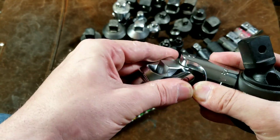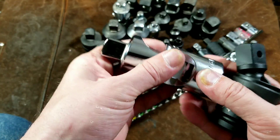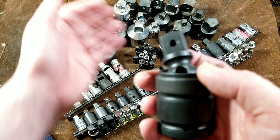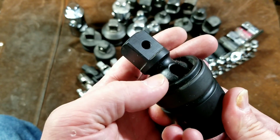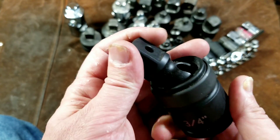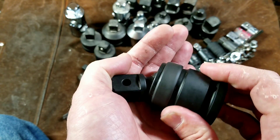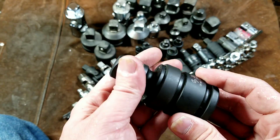Standard universals are a little notchy and clunky because of the way the joints are offset, but they're a real lifesaver. They're also smaller in diameter than their impact counterparts. The impact counterparts are constant velocity joints — the pin drive in the ball socket is the universal standard and is very smooth. It only has 30 degrees of articulation, but they work absolutely perfectly.